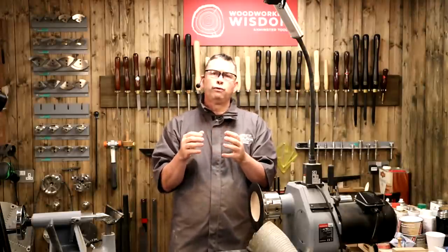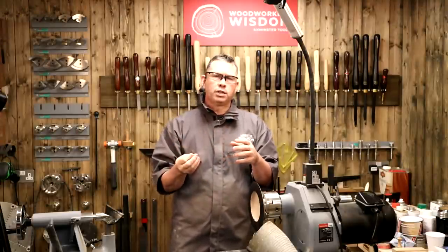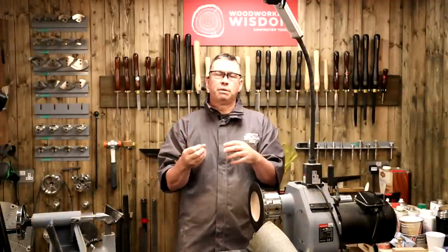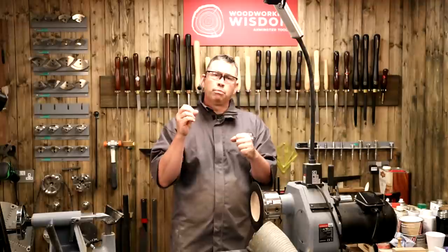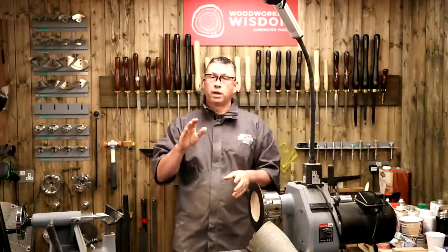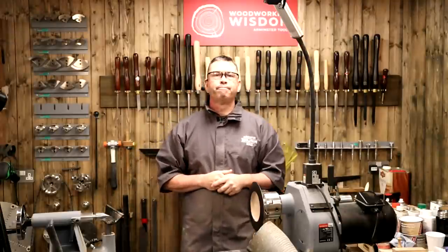I wouldn't go too fine with your abrasive either. 400 is enough. You don't want to create a glazed outer surface of the timber. The stain struggles to break that barrier if you do that. So about 400 grit. But get rid of all the scratches, but just stop at about 400.